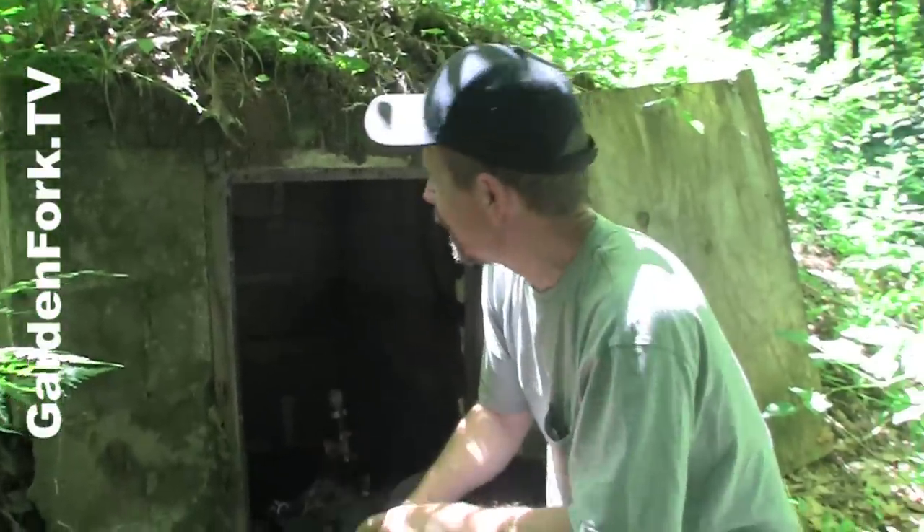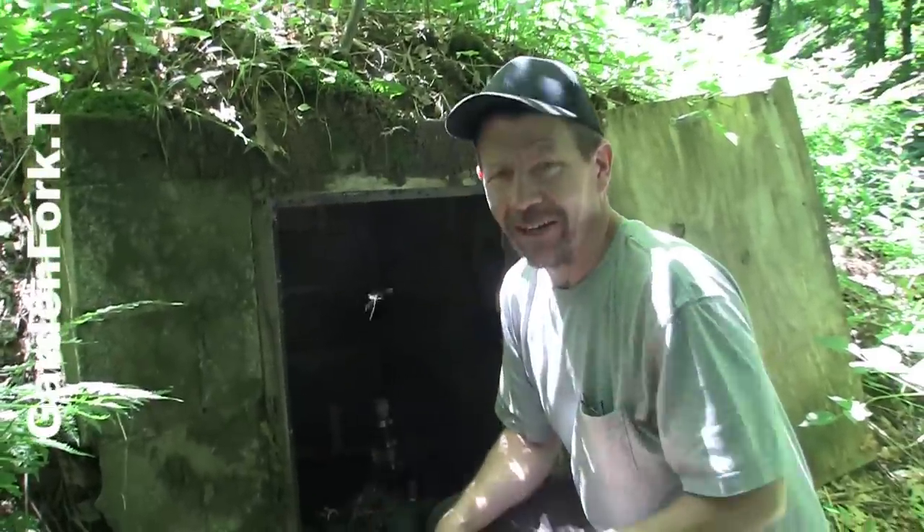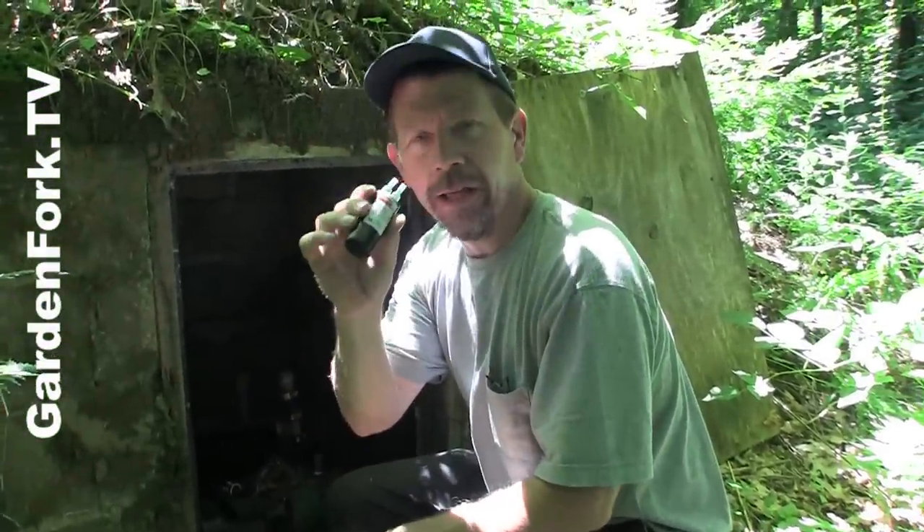Here we are in the pump house. There could be a lot of mosquitoes back here. Talking to Mike, he suggested that we replace the capacitor on the electric motor, because when we turn the circuit breaker on — the power of the pump — it stays on for a couple seconds and then it pops off. And that suggests that the capacitor is bad. These are 15 bucks, it's worth a try.